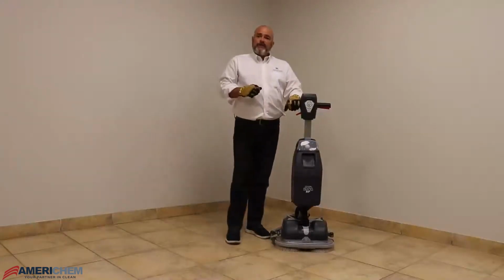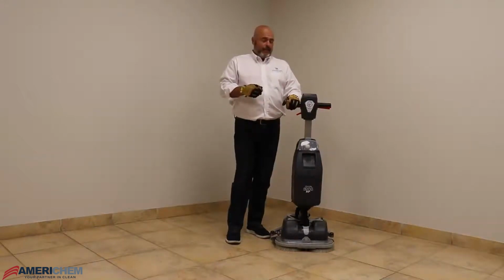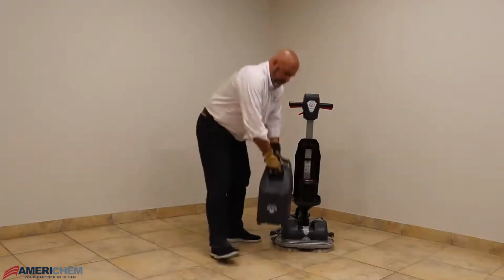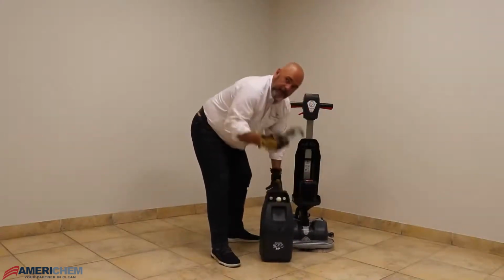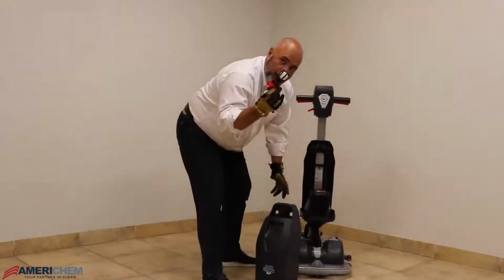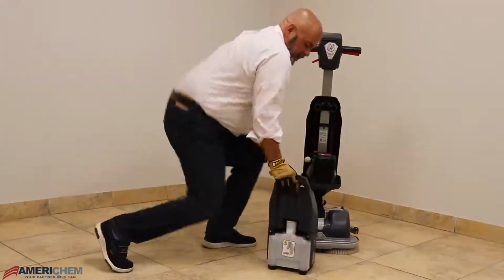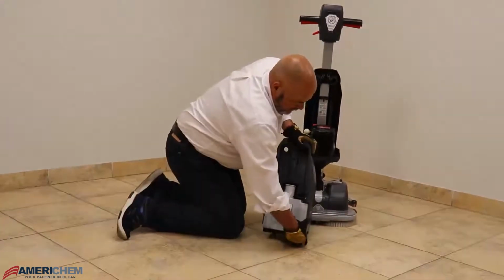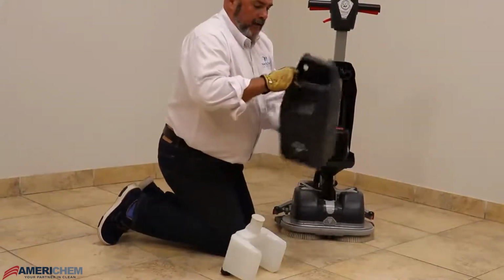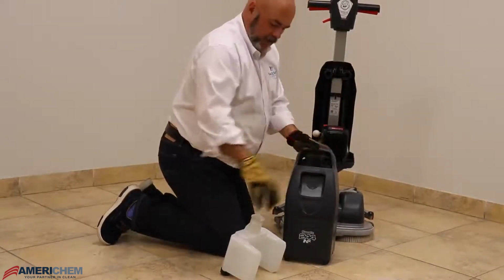Okay, so now at the end of your shift, you've used the 244, and I'm going to show you how to operate it, but now we're going to dismantle it as if we're going to clean it up. So the first thing to do is you're going to lift off the dirty water tank, set it on the floor, and remove the lid. You're going to remove the float ball, always clean the float ball. You're going to remove the clean water tank just by sliding it out. You're then going to take the dirty water tank over, dump it into the sink or toilet or wherever you're going to dump it, give it a rinse.